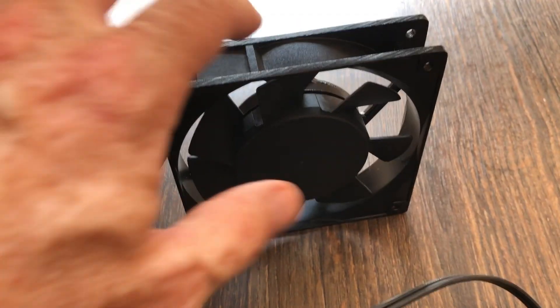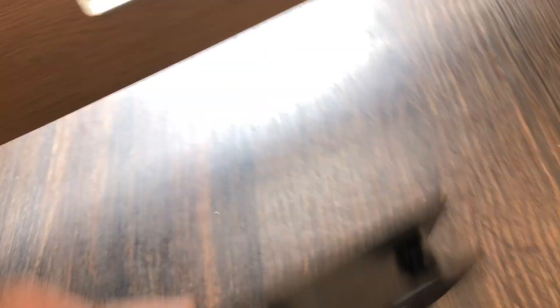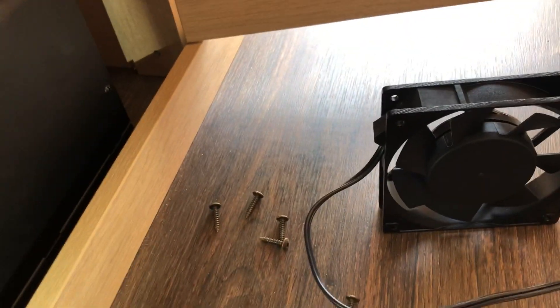This shows you the direction of airflow on the fan and on the case itself — the way the blades turn will blow air that way. This side goes inside the cabinet and this side faces outside. It's an awfully tight fit, so what I'm going to do is plug in an extension cord with a flat plug so it doesn't get bound up back there. The plug for the fan is being compressed by the short distance between the inverter and the wall, so there's not enough room. The extension cord with a flat plug gives me plenty of room for the wiring inside the cabinet so that it looks clean, and then the fan will mount right there where I've test-fit it.